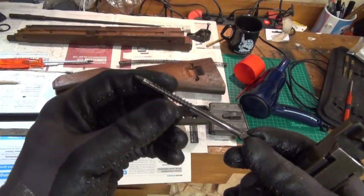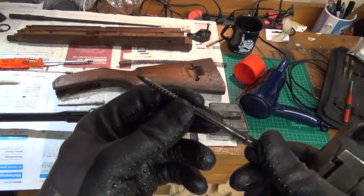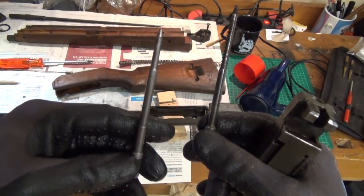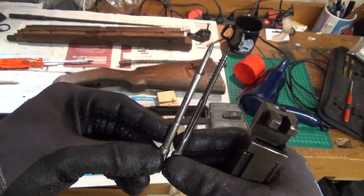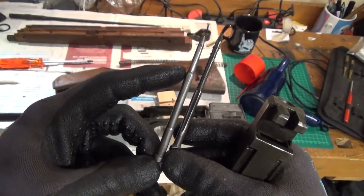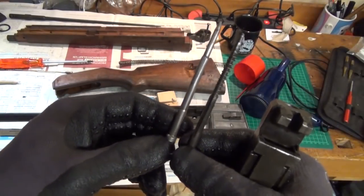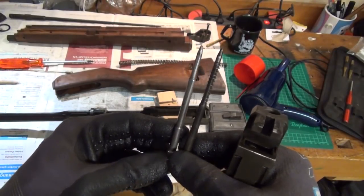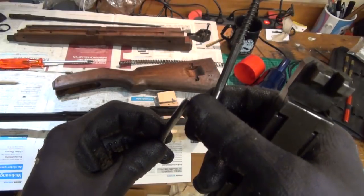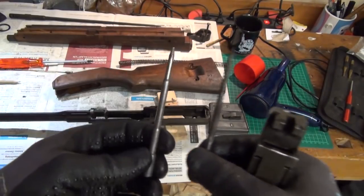And here's the firing pin. Now it's all cleaned. You can see it's fairly slim. It's got three flutes on it. And here's the spring that finally popped out, so that there's no slam fires. And this is the strengthened MAS44. You can see it's a much bigger thing. It's got a far thicker stem portion here and a longer main bit, and then tapers down, and it's ever so slightly fluted just at the tip section, these two portions here. And yeah, so if you do have slam fires, one solution would be to turn this down a bit and fit a spring like this, or the French one, taking just half a mil off the tip and buffing it nicely into a nice rounded tip there, and it solves the problem.